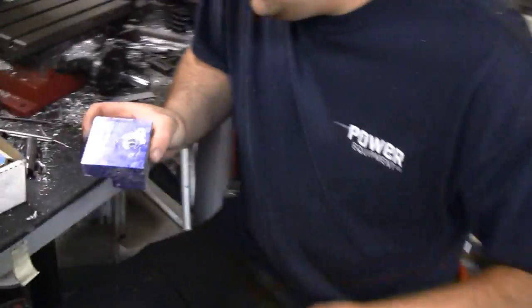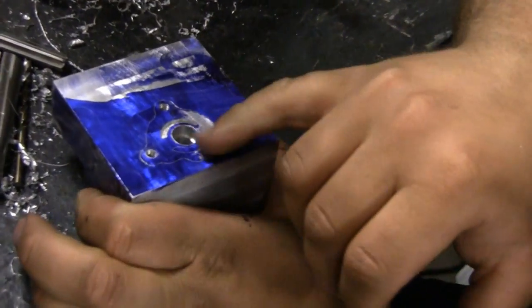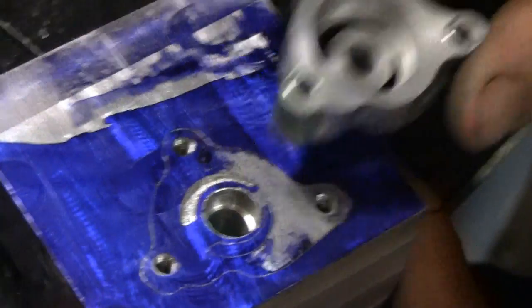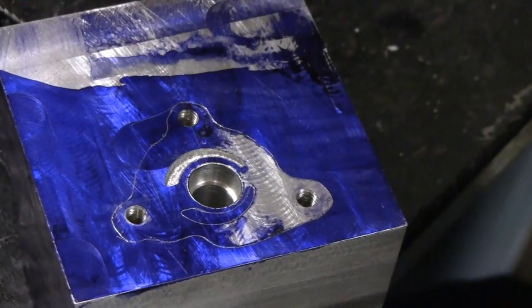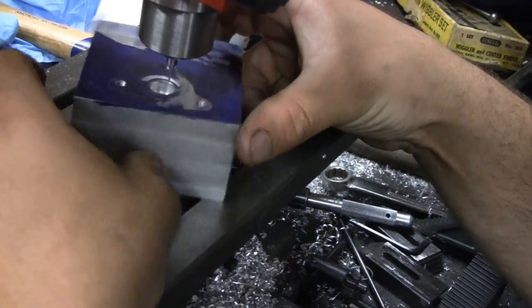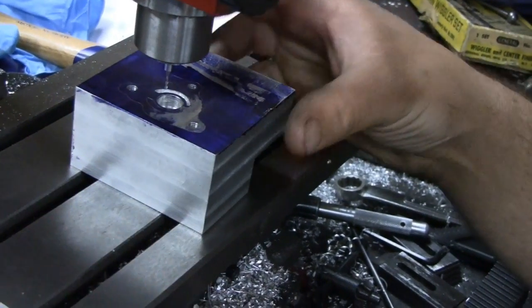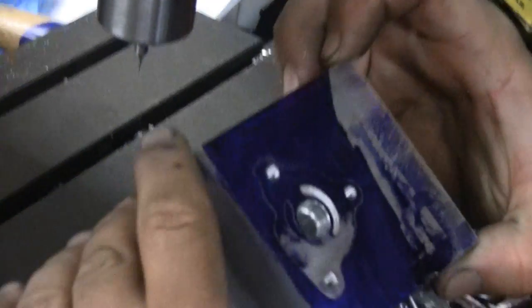Let's see how Mike's doing over here. I got one of the ports milled out — right here, little moon-shaped thing. Little half moons. That's where the oil pump will sit. How did you do that? I actually did it by hand on the mill. I used a small — I think that's a 3/64ths end mill there — and I just take light cuts and follow my trace line, nice and slow.